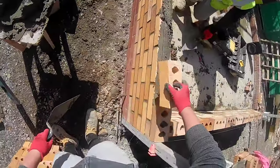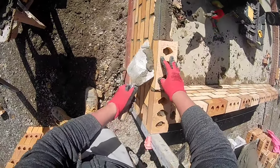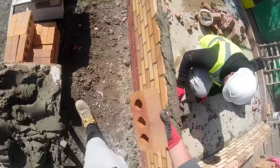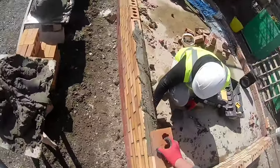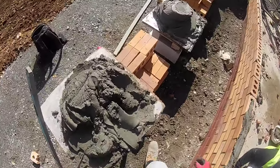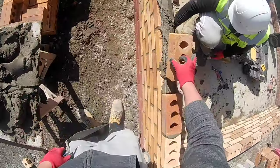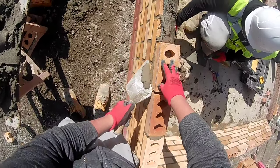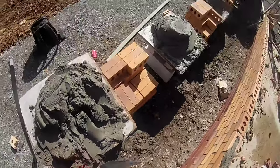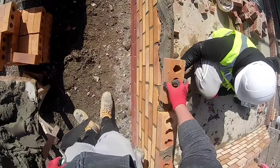And you've got a bit more play as well. If you have to pick up or tighten down because you've got high in your block work, you can easily have that play with two or three course of commons. Obviously I put a common, then a block, then another two course of commons to play. So you can easily play with your play tight if you've got a laser level or something like that. If you want to level it up, perfect. But if your measurements are right, there's no reason to really use a laser.